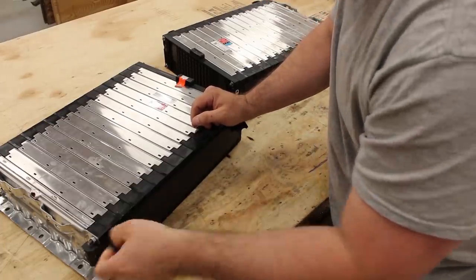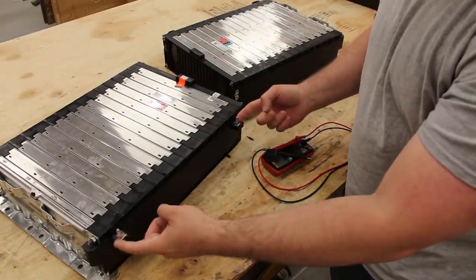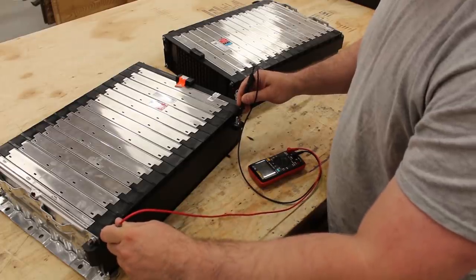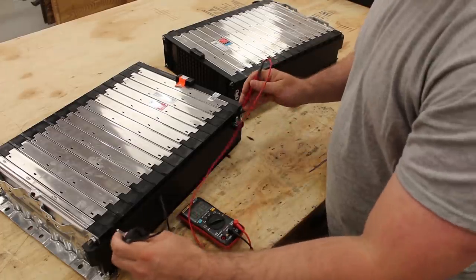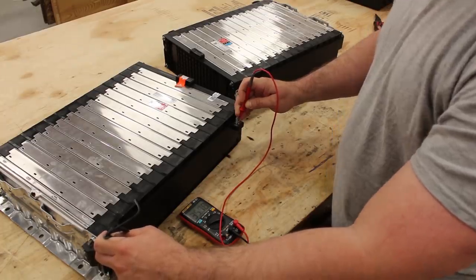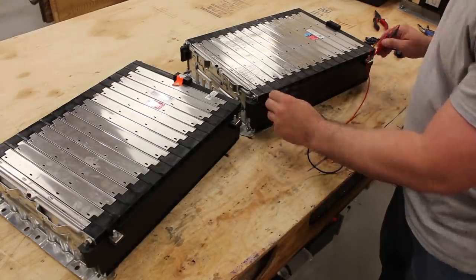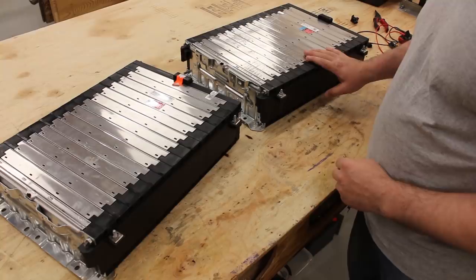Let me pull off some of this electrical tape. It looks like a steel stud coming up on each end — maybe 10 millimeter, we'll find out. I don't know which is positive and which is negative so we'll check them. That's opposite — so this is negative and this is positive. On the multimeter we've got 35.8 volts. Over here this one is 35.76 — pretty much the same voltage, which is really great. We could actually parallel these right now and it wouldn't be a problem.